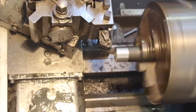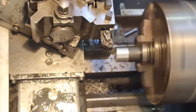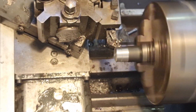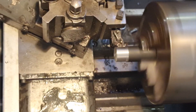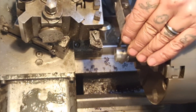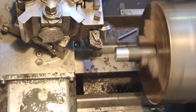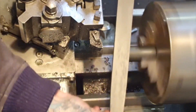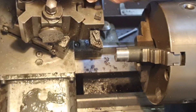We want 23mm - come on - 23 point nothing. And it needs to be 15mm long. It should be 23mm - near as damn it - 23.14, that'll do me. Now break that edge, give that a quick polish. Now we're going to counterbore it for M8 - we're going to put M8 clearance in. Get our centre drill in and get on.